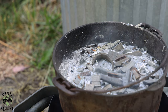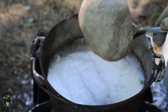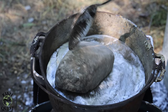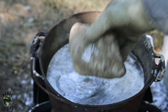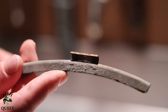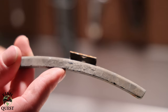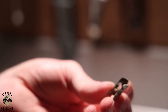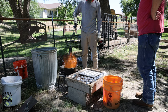Lead is extremely dense, and as a result many of the imperfections found in wheel weights will float — the steel clips will float, and gravel, dirt, rocks, whatever have you will float on molten lead, which is ideal because we need to remove these imperfections. Wheel weights typically have two parts: the lead weight and the steel clip used to hold the weight to the wheel. By melting these wheel weights, it will free the steel clip from the lead, allowing you to scrape off these imperfections and throw them away. If you have a propane ditch torch, I highly recommend you use it.